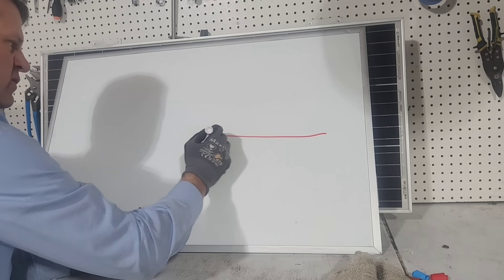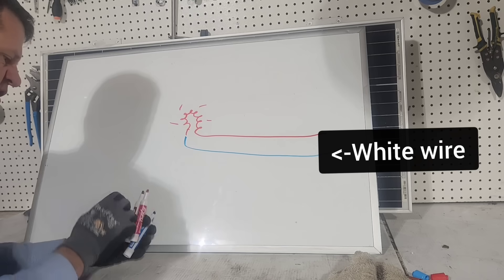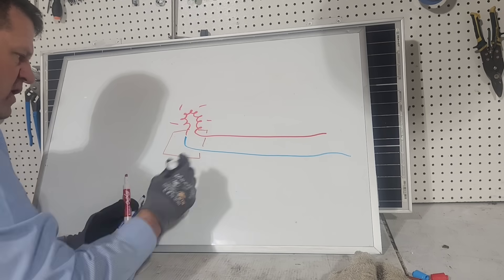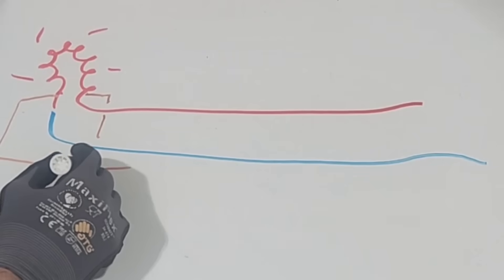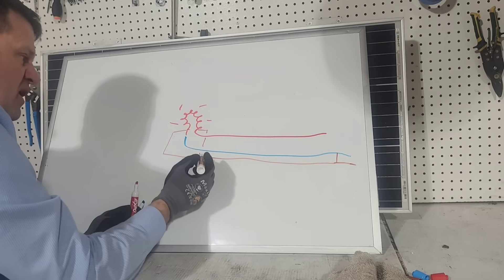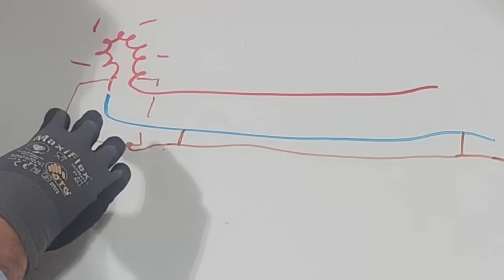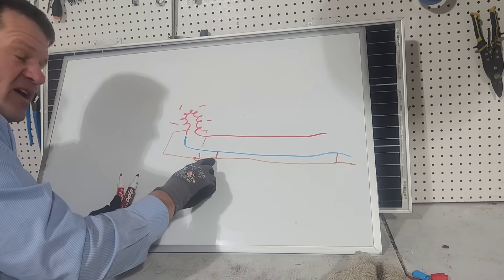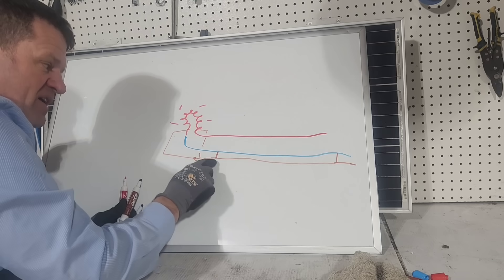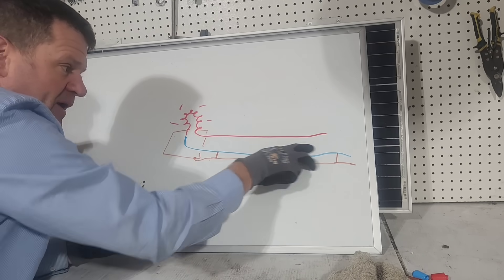Say I have a hot that goes out to a light bulb, and power goes back on the neutral. There's a grounded metal electrical box, and I've got my bare copper ground connected to the box. It goes out and say I have my ground neutral bond as it goes out to the grid. Now, if I have multiple ground neutral bonds in my system — say there's another one, or say I have a subpanel downstream — suddenly my return power has two parallel paths. Under normal operating conditions, there should never be current on that copper wire, but now I've got a parallel path for current to flow through.